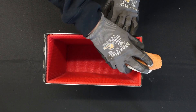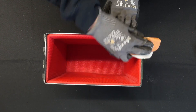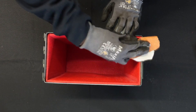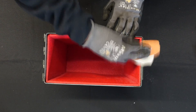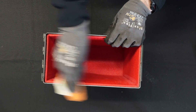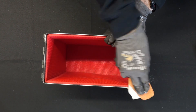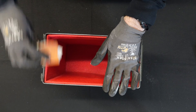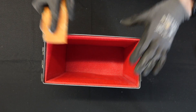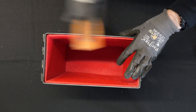Make sure to leave a little room on the top edge of the ammo can so we can get our sanding done and also still close the can properly. The sanding can be done with a metal file and/or sandpaper as we're only removing the paint from the top edge. We have to expose the metal because we are going to add several layers of aluminum foil to this and we want to make sure that we have a good metal-to-metal contact.